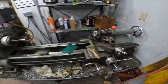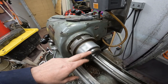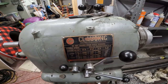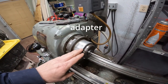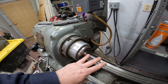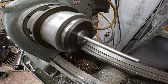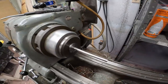It also came with a spindle protector and collet adapter. This is a Colchester collet chuck - I think it's like a Mark 1.5, 13-inch Colchester. The cool thing is the reason you want a collet chuck is because typically you can hold your work much more precisely. It's much more concentric and it's a repeatable or easily repeatable position. It's a lot easier than setting up a four-jaw. You are limited obviously by the size of the collet you put in it - you can't hold huge material like you can in a four-jaw.